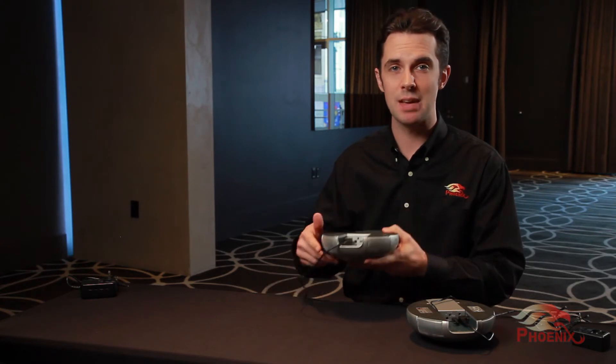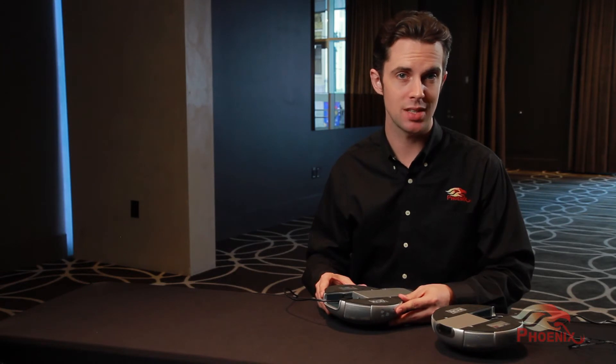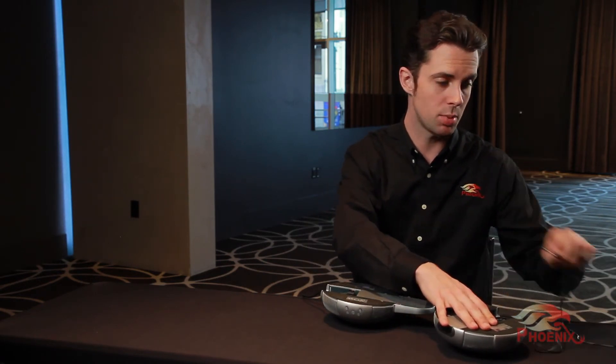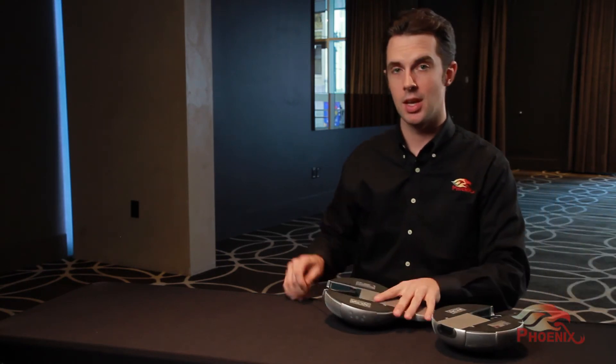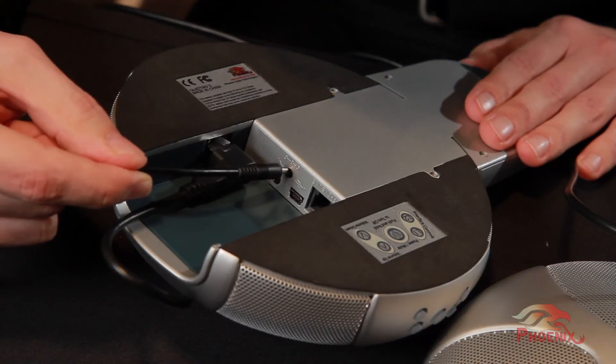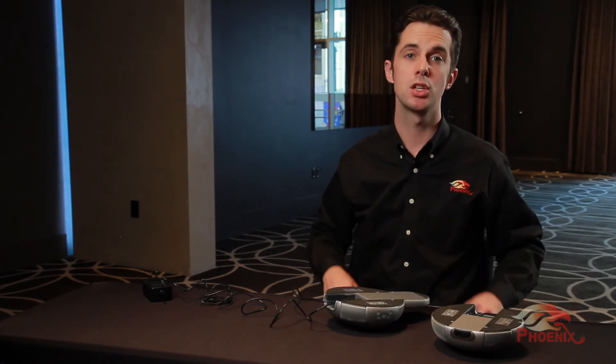All the models outside of the MT301 support this function. In a similar way to what we demonstrated before, designate the first Quattro in the chain. Use the daisy chain cable provided with each unit to connect between units as we just did. Since we're using a central power scheme, we don't need to have all the units connected to their own DC power supply. Now connect the 48-volt power supply to unit number one. This power source will power all the units in the chain. If your chain has more than eight units, you will have to connect an additional power source to unit number nine.